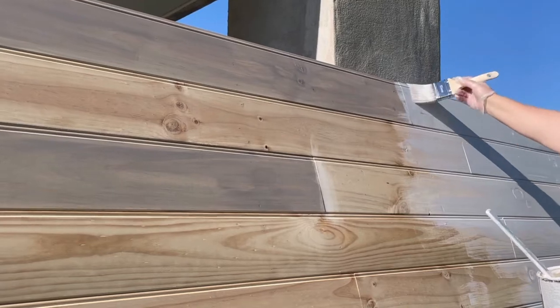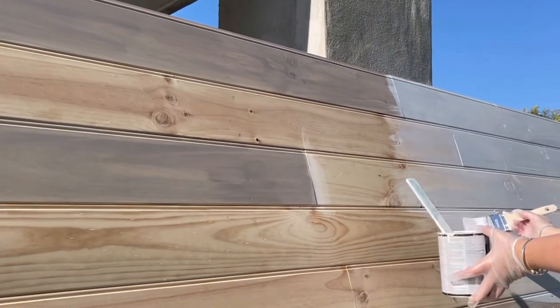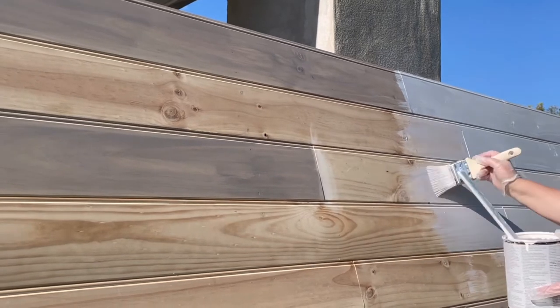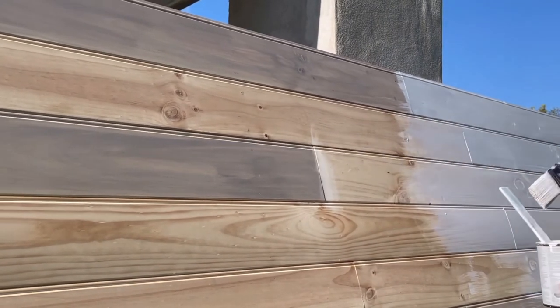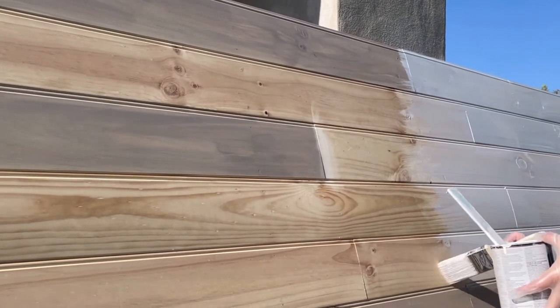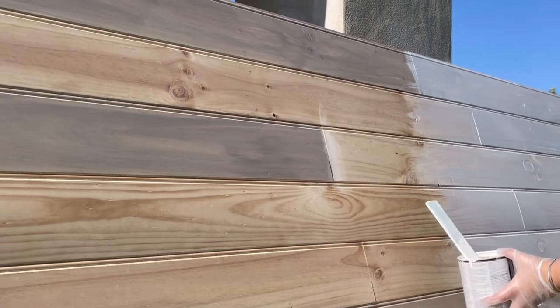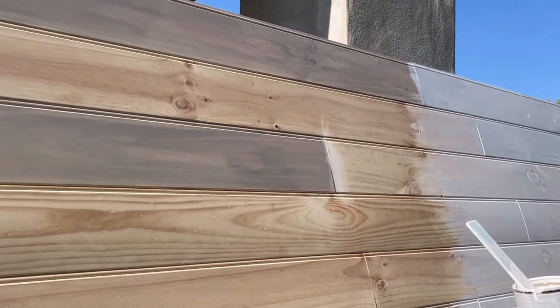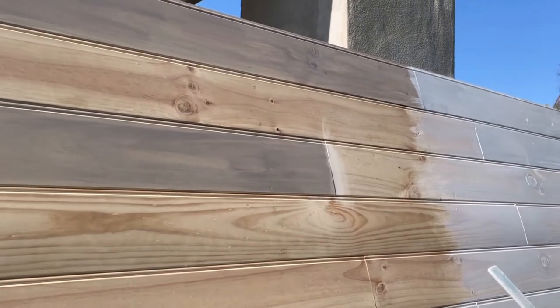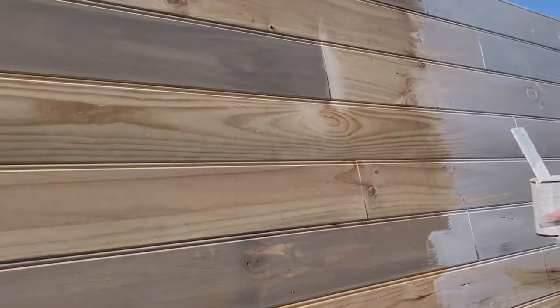After the wall was finished being built, I randomly stained some planks here and there. I tried not to make it symmetrical, but it kind of was a little bit. So I stained them with Storm Stain and Glaze by Pure Eco. And then after that dried, I brushed over some Feast Watson Liming White. And then I wiped that away with a cloth.